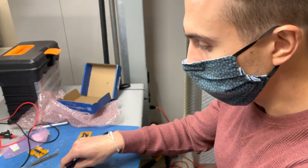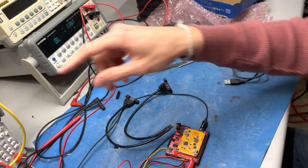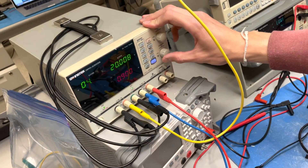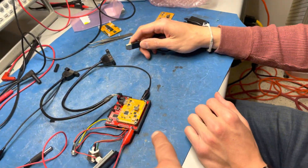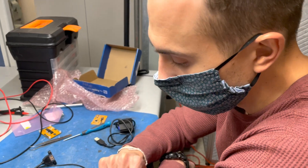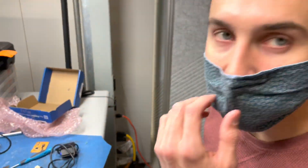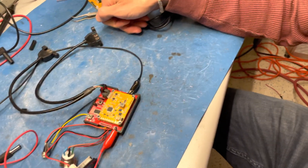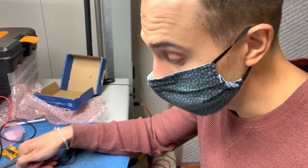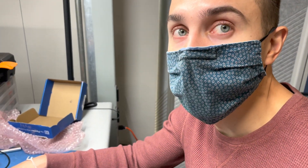Now let's test those USB ports. This is connected to the jig here, split into two pieces — USB A. I'm going to turn up the current to make sure we can supply enough power. Quick question, Fedor: what is this solid-state switch rated for in terms of voltage? On the input, 60 volts max. You can handle a good amount of custom batteries, power walls, bikes, scooters, a lot of LEDs. What is the current we can push? On the main load on the muscle board, you can handle 60 amps continuously and in bursts up to 120 amps — and when we tested that, it was rock solid.